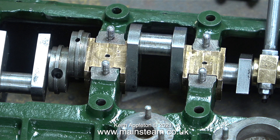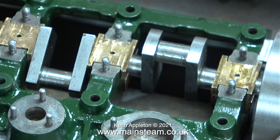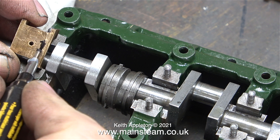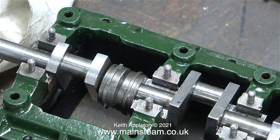The top parts of these split bearings are recognizable because they have center pop marks punched into them. The bottom parts don't have anything stamped on them, but they only fit in the slots they were made to fit in, so that's not too difficult. When I neatly arranged the bearings in a row I put the respective packings with each bearing, but unfortunately these got mixed up too. To make everything more visible I'm marking everything with a felt tip pen.